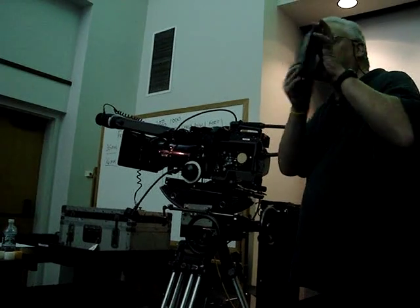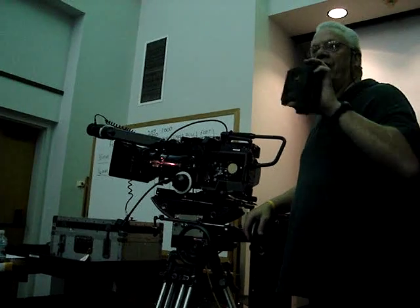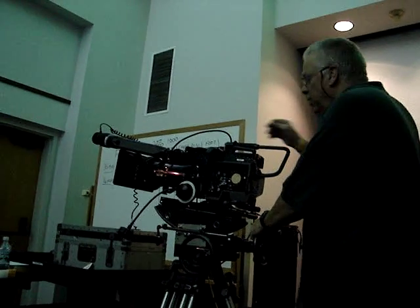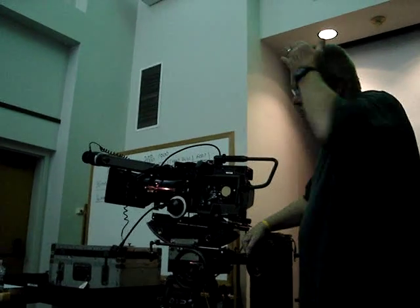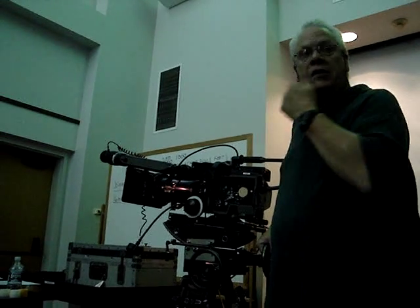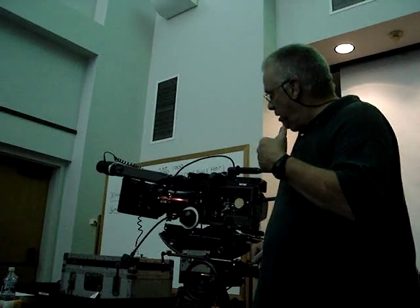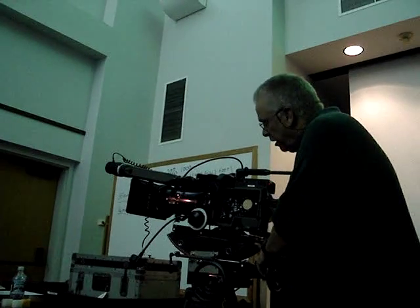The reason I want to tilt it up is so the door stays open, because for beginners the door has a little diagram — a little cheat sheet, I like to call it — in case you've forgotten how to thread the film. For purposes of our demonstration I'm going to take it off and take off the top handle. There are two things that are going to prevent the film from fitting into an area of the camera called the gate: the registration pin and the pull-down claw.